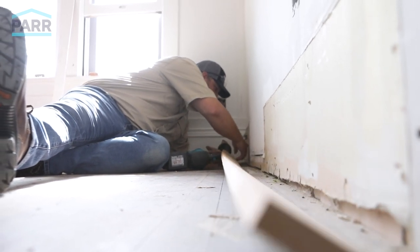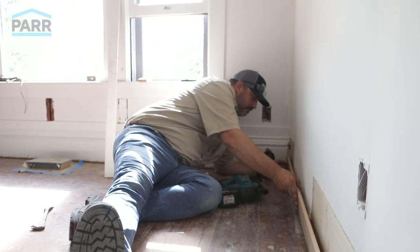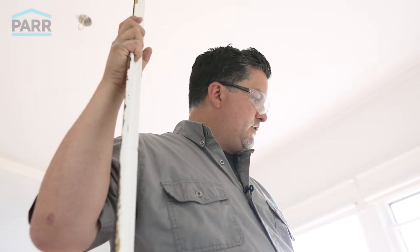To start, we have to use a half-inch spacer against the wall. So we're going to do that first with a piece of scrap half-by-four that we had laying around. And then across the top of it, we're going to put our half-by-six. And then the middle will go that profile — this profile right here — and that'll go in the middle. So Tony's going to nail that up to the wall and then we'll put the half-by-six up next.